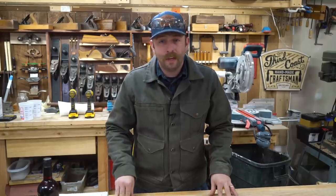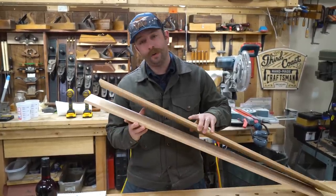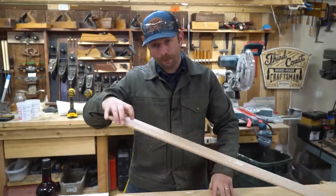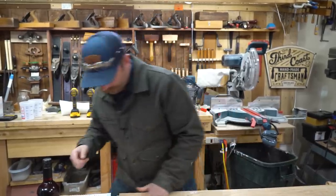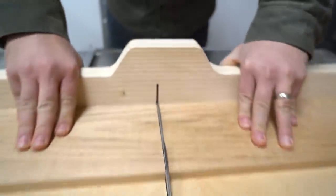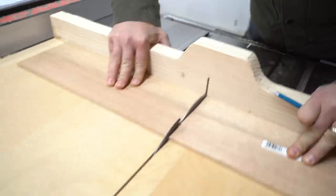All right, now we're gonna make a nice little wine gift box. Now, Lowe's had a couple of oak boards that were already dimensioned, so these are 1/2 inch, and I have a 1/4 inch board for the lid. We're gonna do a little bit of dovetail joinery on it, so let's get started. The first thing I'm gonna do is cut all my boards to their final length and width, and instead of trying to explain it all here, I'll just put those measurements down in the description.